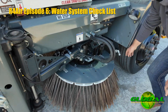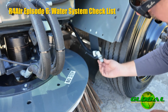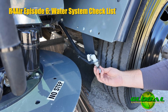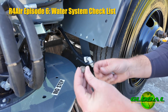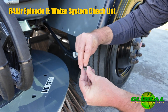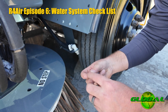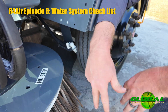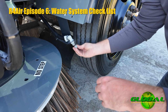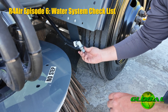Checking the water nozzles — you're going to notice we have two nozzles on the right gutter broom and two on the left. These just have a brass tip — a nylon nut with a brass tip on the inside. On occasion, make sure you do take those out and make sure that they're clean and the water is flowing. You'll notice that this should put the water down like a fan, so you can actually turn these directionally to make sure it's spreading the right way in front of the broom. Again, two tips at each gutter broom, and at the front spray bar you'll find the exact same thing with five tips.